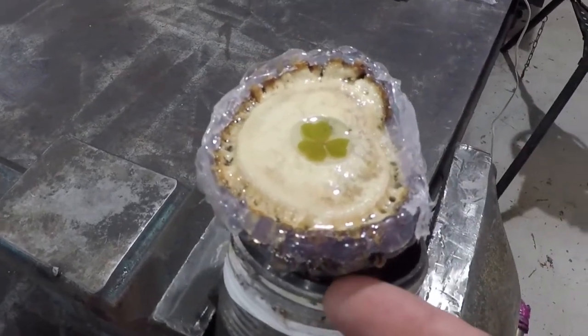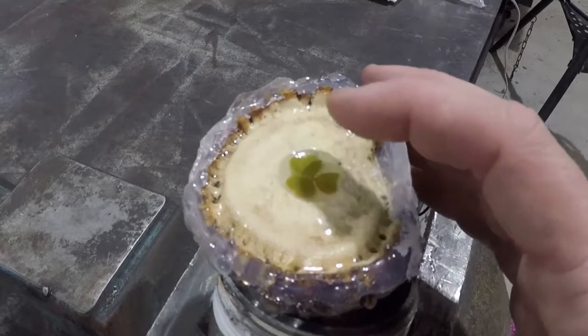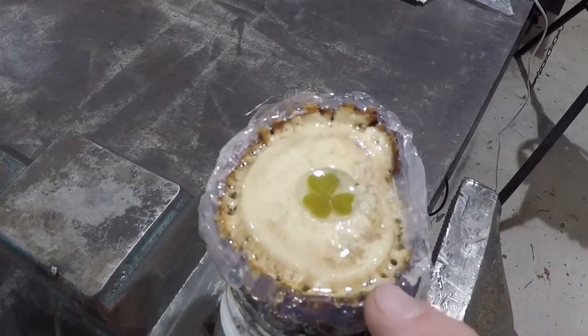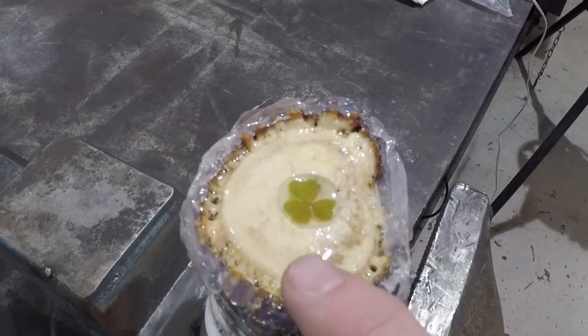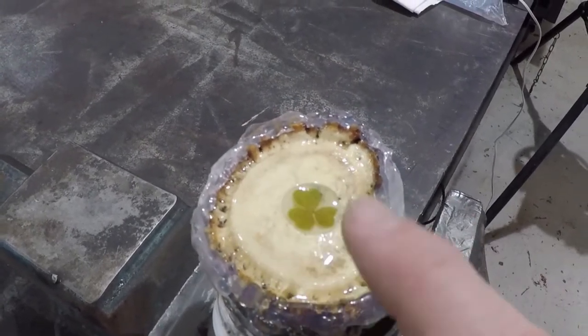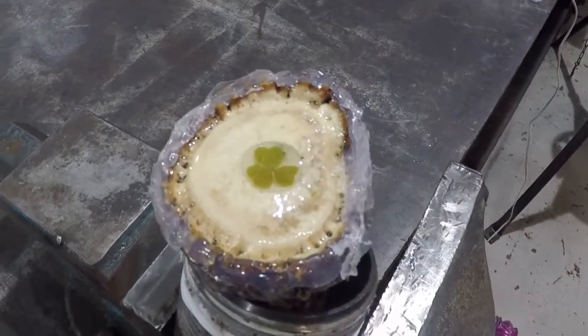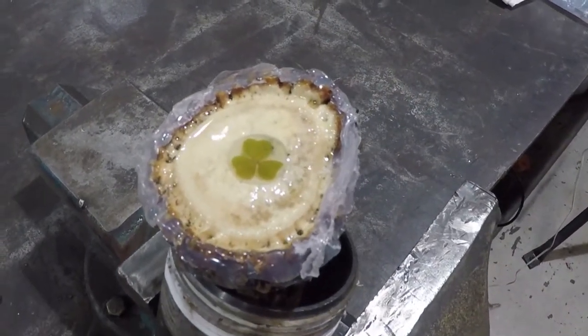And then down underneath the horn, I put it all along the bottom of it, because some of these holes, like these ones here, go all the way through. So I'm hoping that'll keep the epoxy from leaking through, and will just give me about an 1/8 of an inch all the way around on top of this to give him a really nice smooth top on the handle. So let's go mix up some epoxy and hope for the best here. Hopefully nothing leaks through.